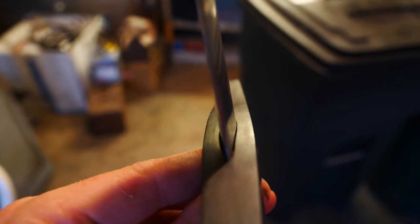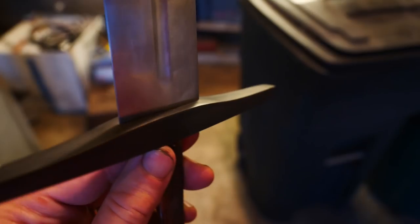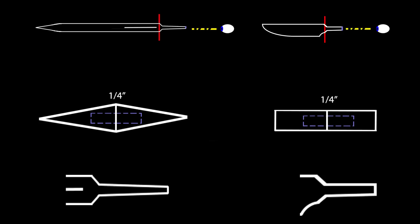In the meantime, filing the guard — I opened up a few small gaps, got a little overzealous. Where the guard meets the ricasso, my current approach on a knife — where you have a rectangular ricasso — is to file in shoulders. Looking at the cross section through that area, we have a rectangle for the knife and a diamond or oval shape for the sword. The blue dotted lines are the ends of the tang, and our width is arbitrarily about a quarter inch for each piece. We'll file in shoulders — small flat shelves.